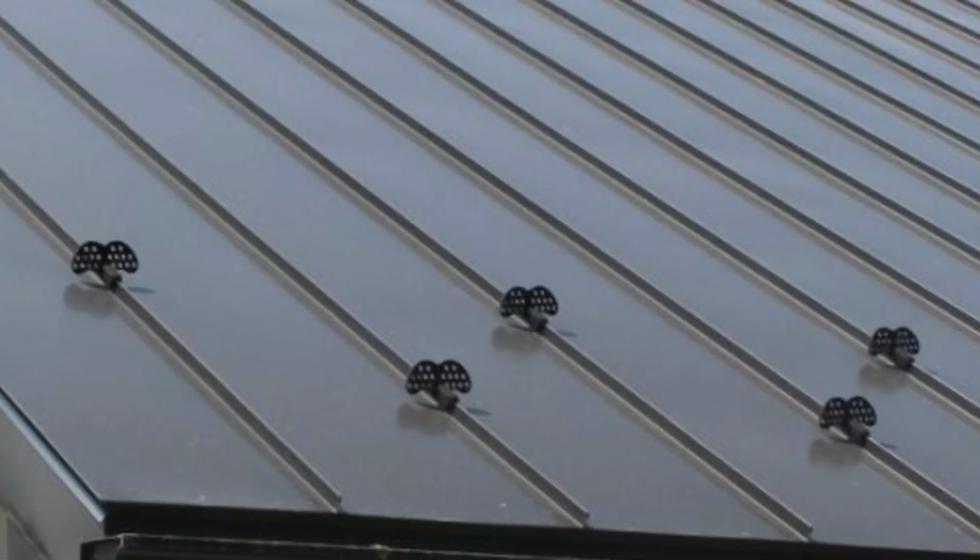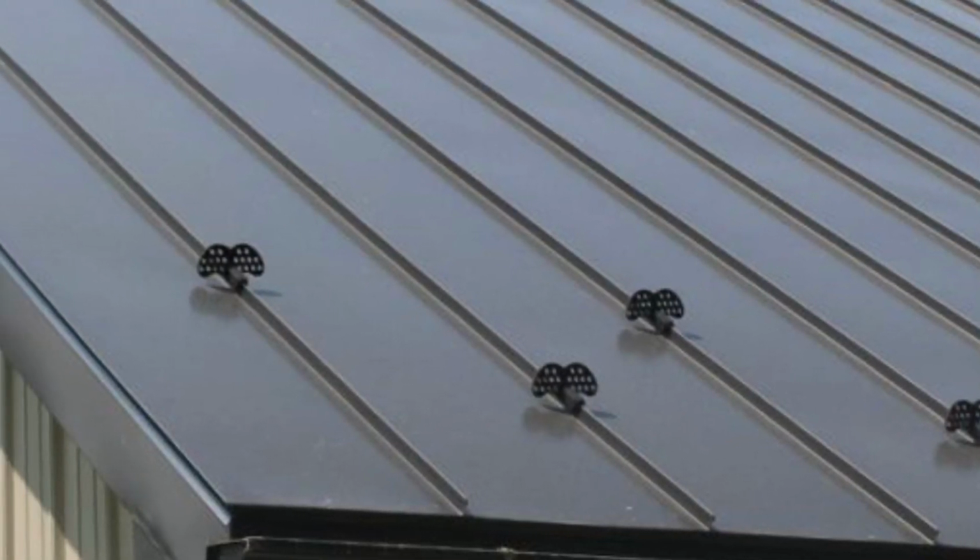And this actually happened to a house of mine that I lived in once, and big snow melted down, ripped my gutters off. Boom. And one last note about metal roofing is there is somewhat of a debate between the roofers I use anyway of whether metal should be screwed down directly to the plywood layer of your roof or whether it should be spaced up 3/4 of an inch on pine strips, leaving an air gap between the bottom of the metal and the top of your underlayment. So that's a debate that I've heard roofers we use go both ways. I'm not really sure what's best, but I'd love to hear your comments on that.